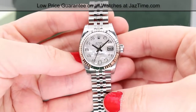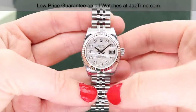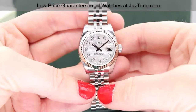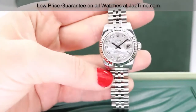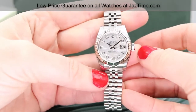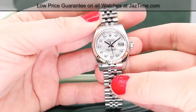This is something that Rolex pioneered — a system of waterproofing their watches by screwing down the bezel. On this watch we have a fluted bezel, the part all the way around here with the ridges that reflect the lighting really beautifully. By screwing down the bezel, the case back, and the winding crown on the side, all of that screws down to give us a watertight watch — referred to as an oyster case. This one uses a twin lock double waterproofness system, keeping the watch water resistant to 100 meters.